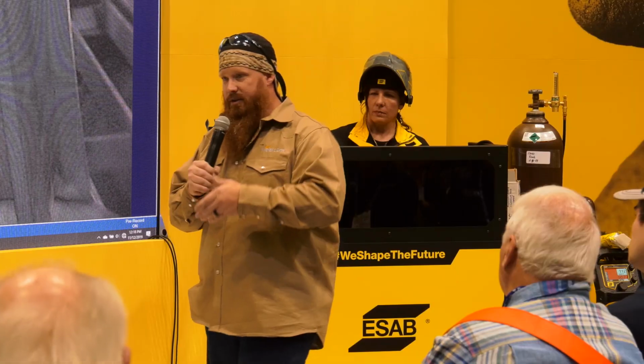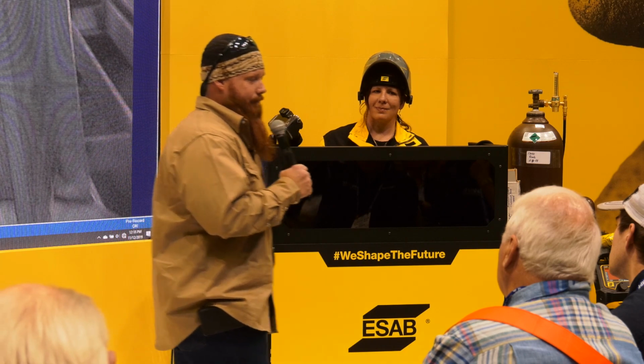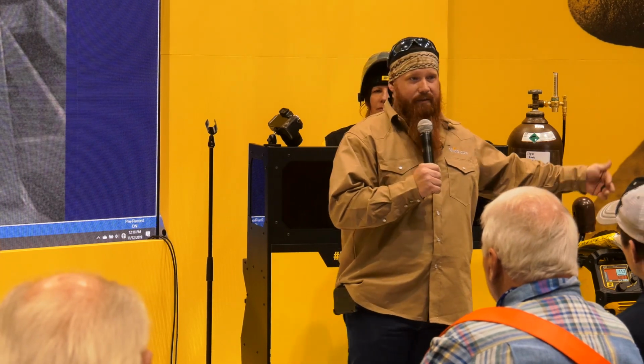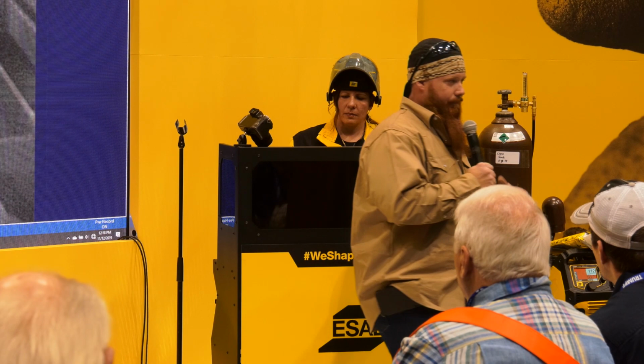5 divided by 32 gives me about 165 amps. Somebody can check my math, call me out on that. But it's going to be a good place to start, and then you can adjust from that position, up 5, down 5, wherever you like it. It just gives you a good place to start, a good rule of thumb.